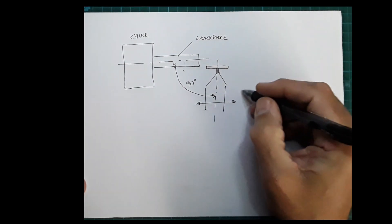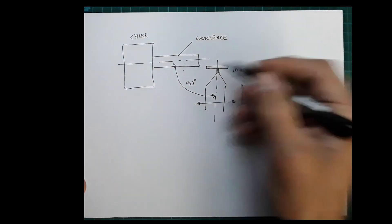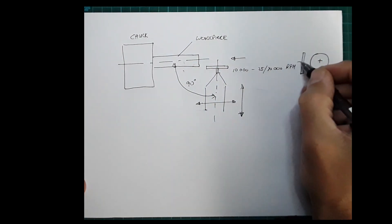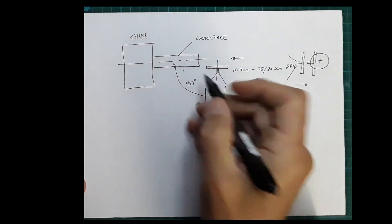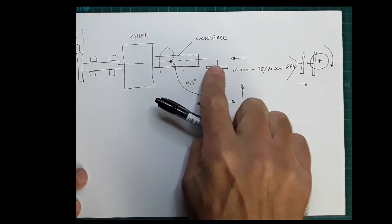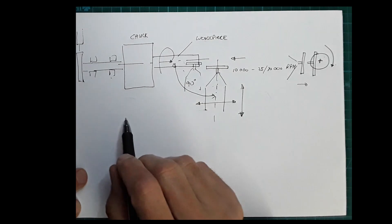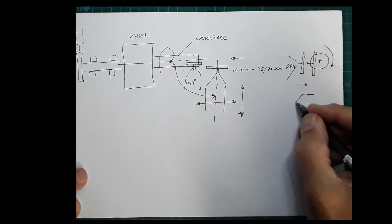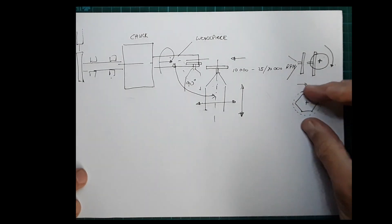The first example is cutting a hexagon on a round object. Looking along the axis you see the shaft with a centerline. Moving the cutting disc inwards into the object, you cut a slot. After moving the disc in, indexing — meaning rotating the part — and repeating this six times, you end up with six flat sides on the shaft. This part is normally the end of a bolt, and you use a spanner over these flats to torque or untorque it.